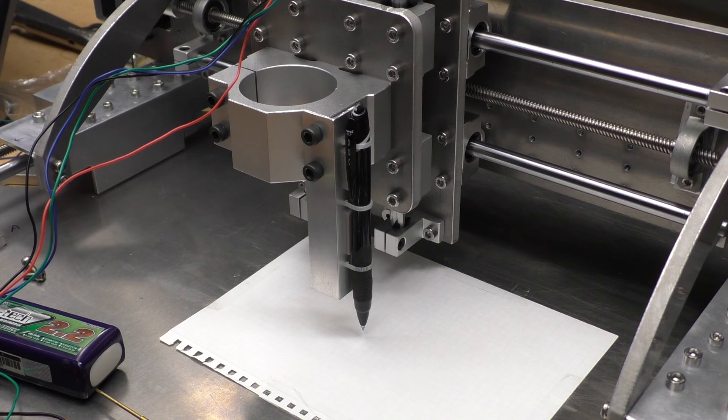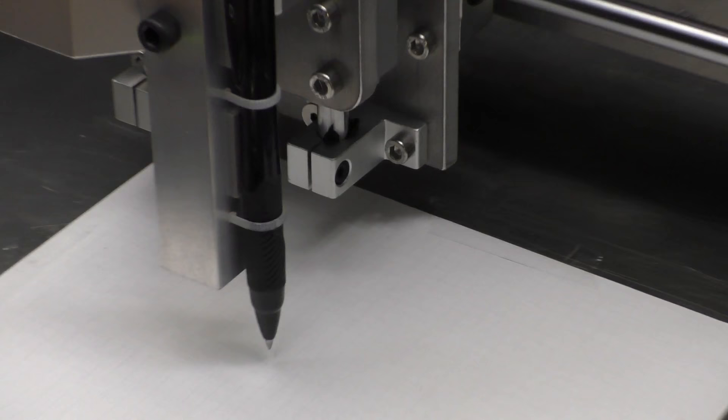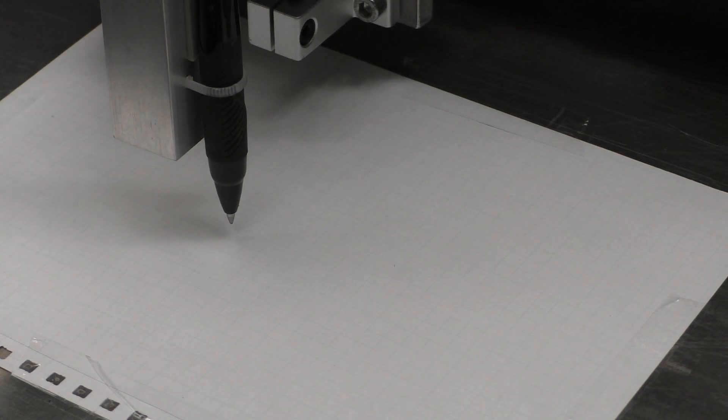So I made a little aluminum bracket and zip-tied and foam-taped the pen on there, and it seems to be a lot more stable now so there shouldn't be any of that wobbling around, and it's actually going to draw on paper. I've set the cutting depth to half a millimeter, so I'm going to jog this down to just under half a millimeter above the surface.